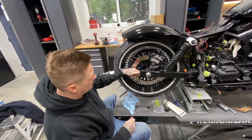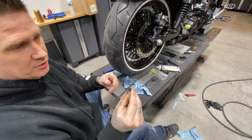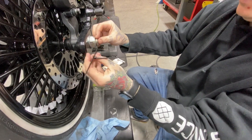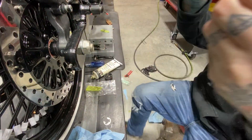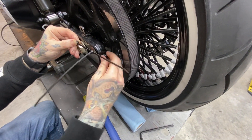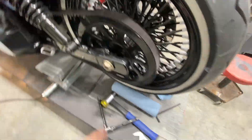When adjusting the cam nuts on the back to make the tire evenly spaced with the belt, there are probably a lot of different tools, but I actually just grabbed a zip strap. Zip the strap around it and then hold it centered like that, and now I can measure on the other side to make sure it's where it needs to be. This one has to come forward a bit so I'll adjust accordingly and get it lined up perfect. Got the belt at perfect tension, all the cam nuts are adjusted, brand new brake pads.